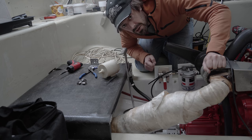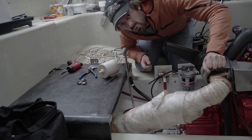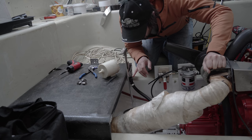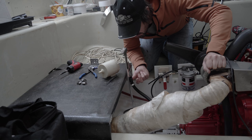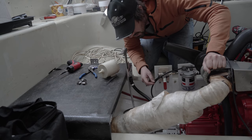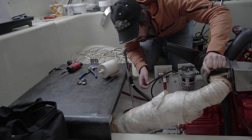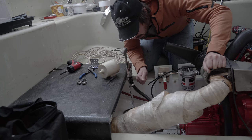Now, I thought that might be okay to keep on, but it turns out the hose is a real mess. It's gone all floppy. It's where the Jubilee clips have been attached, it started to add to the perishing of the rubber. And so yesterday I actually noticed a few drips of oil after I slightly edited the length of this line. And it basically says to me that it's knackered. So I'm gonna change that over so we have a fresh bit of hose on here.